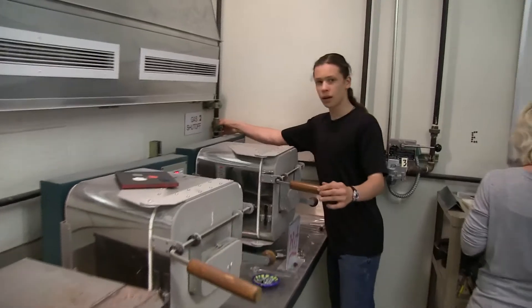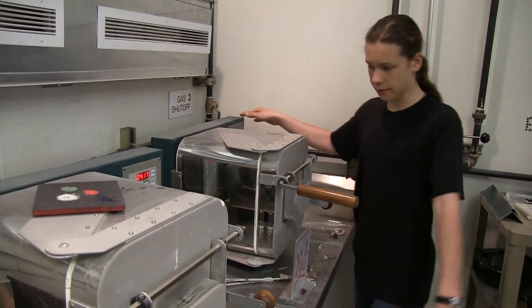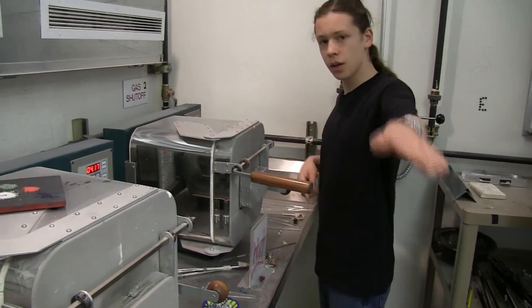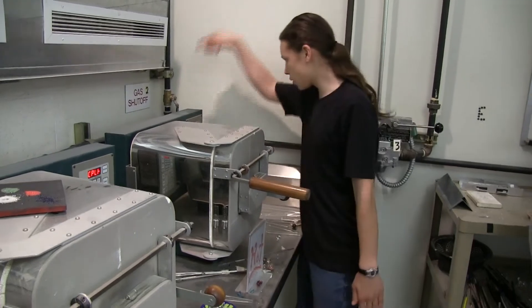This is step two — it's called gas shutoff number two. You turn this on and go all the way down. It's kind of like a valve: gas is going to be flowing whichever way the valve is pointing. So if the valve is out to the side, the gas flows out the line; if you go straight down, the gas goes all the way down.